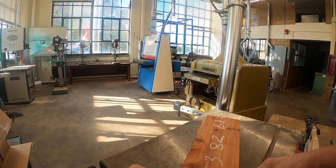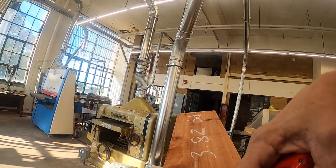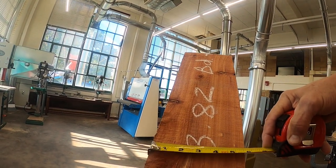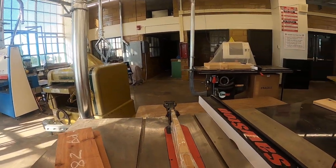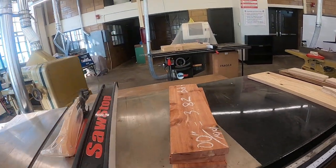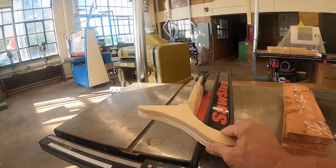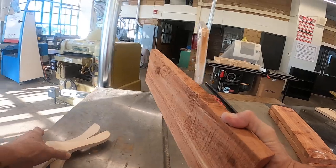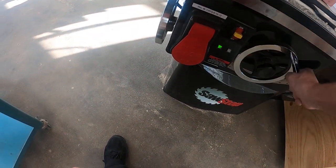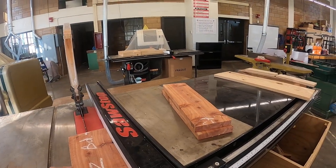These boards are wider than four inches. If you remember, if it's wider than four inches it can warp in the direction of the growth rings, so we always rip it to something smaller than four. This is five and a half, so I'll go half of that — two and three-quarters — pretty close to halfway. Setting up the machine at two and three-quarters. I need to raise the blade just a little — the blade can be a quarter inch taller than your wood is thick. Double-check — that looks about halfway.